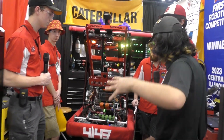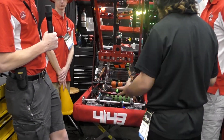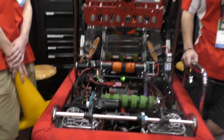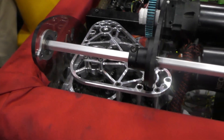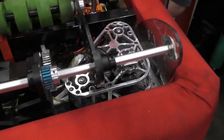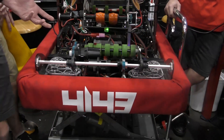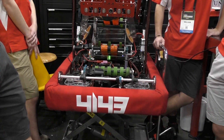Jack, let's start off with you. Talk to me about your drive system — it seems like you guys are using swerve. What specialties do you guys have in your chassis? So this year we actually went with the MK4Is. We've been traditionally known for working on our diff swerves, but we strayed away from those for one year so we can get our robot up and functioning faster and to take a year to rework and revamp the power draw, because last year we were having problems where we drew too much power. So this year we just stayed with the standard MK4Is and they've been serving us pretty well.